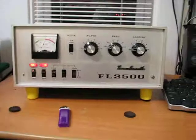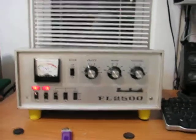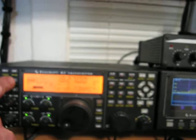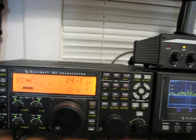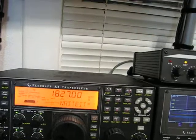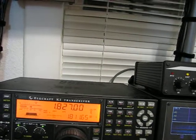The amplifier puts out power — that's not really the problem. It just seems to be an issue between the radio and the amplifier. I just wanted to show you what I'm getting. After hitting AT tune, it settles at 1.4 SWR on the radio side, but it's almost 3 as you can see.